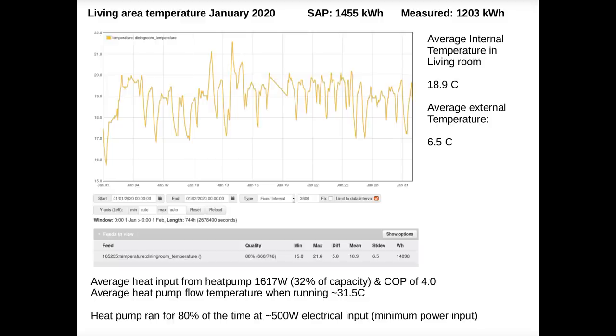We currently take a fairly simple approach to controlling the heat pump. We generally just set a fixed flow temperature for space heating — typically 30 to 32°C — and then turn it on and off manually as needed. We can do this remotely and set a timer if needed. I don't use the built-in weather compensation as the house has a lot of thermal mass, so I effectively do weather compensation manually and always run the lowest flow temperature I can. During the coldest times of the year it can actually make sense to just leave the heat pump on all day, as it's more efficient to maintain temperature at a low flow than to boost a large amount of heat in a short period at a higher, less efficient temperature.